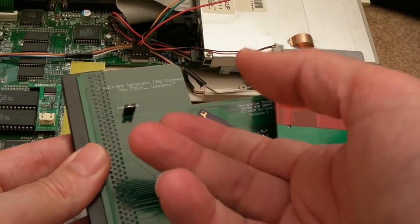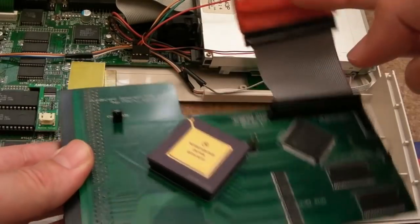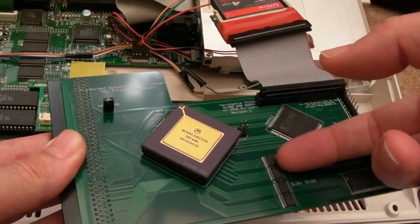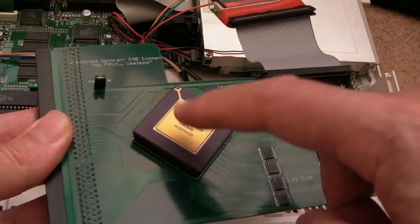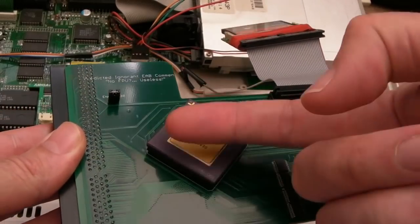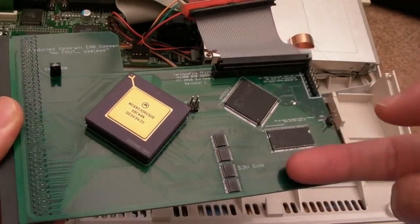Yeah, so the processor is hot. You would want a heatsink. And one thing I did notice is that these are hot. Not too hot, not boiling hot, just hot. So yeah, you would want a heatsink on there, a heatsink on here, and there is enough space, I think, within there. Maybe heatsink your RAMs.